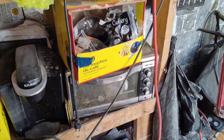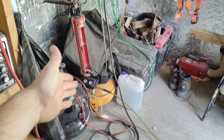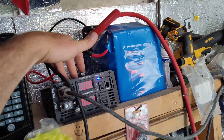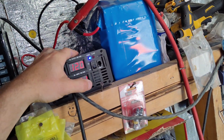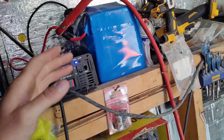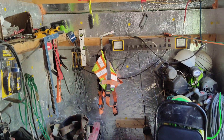I went that route just because he's going to be using power tools just like myself. I know exactly what these high frequency inverters can do so I stay within their limits and have no issues with them. But a lot of people that aren't used to that end up blowing them up — they run something and then put a huge surge on it, and that's what kills them. So I don't want that to happen, so I'm going with the low frequency inverter. It's a little bit more robust.